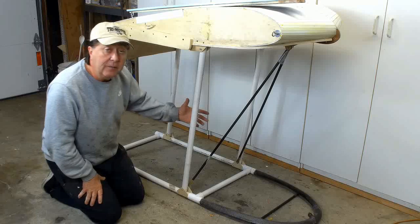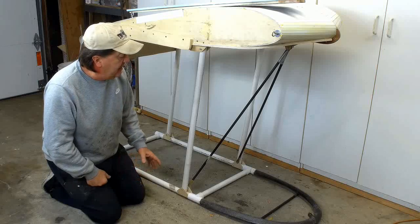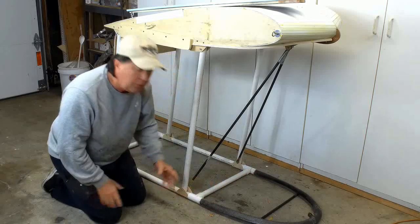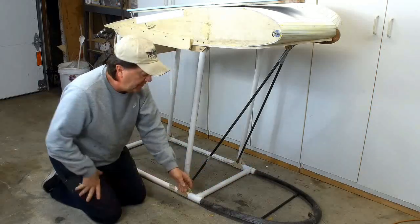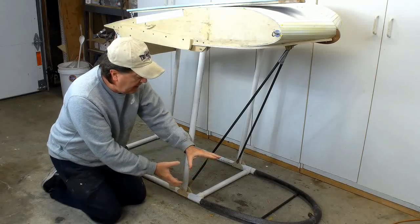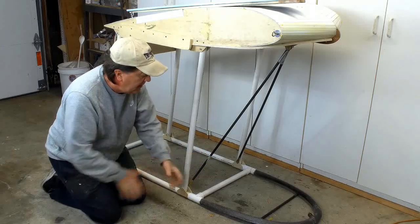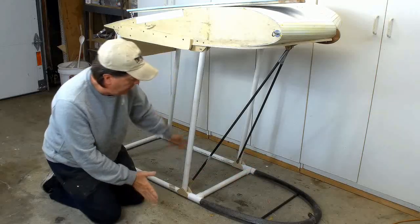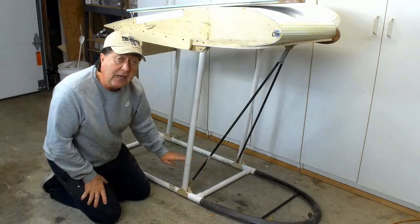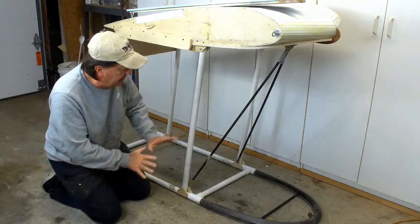All of the tubing will be made using the same methodology that I've demonstrated elsewhere on the channel, with the exception of the front portion of the cockpit. This curved portion will be made pretty much like this one here. There's a wood core with foam shaping and some nice twill carbon fiber that wraps easily around shapes like that. This will be a nice rigid structure that holds the width of the pilot's cage. This bar is not actually in the final configuration. It was done just for the mock-up to keep it all in one piece.